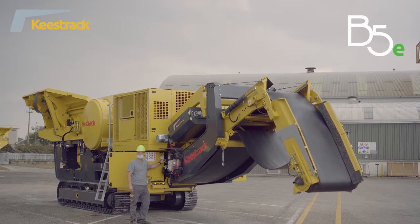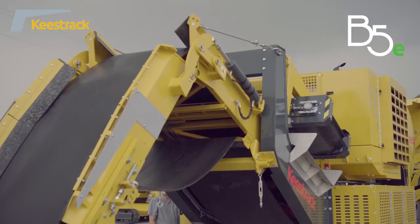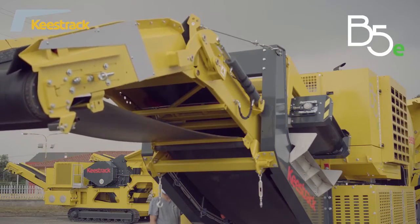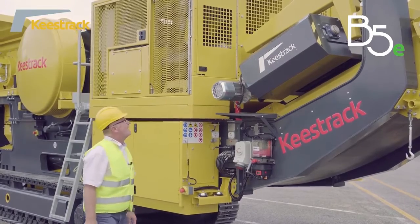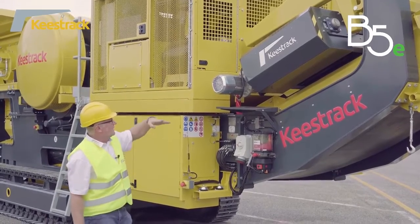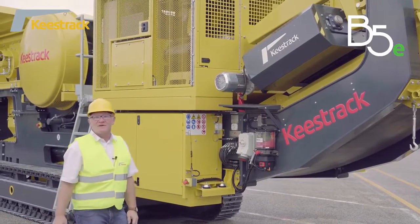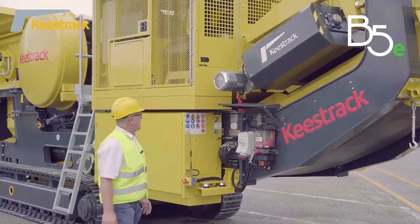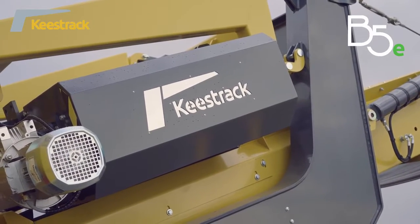For transport, the main discharge conveyor is foldable hydraulically. The drive of the main conveyor is performed by an electric drum motor with a capacity of 11 kilowatt. Optionally, a magnetic separator is available, either in a fixed position as here or with a hydraulic lifting and lowering system. The magnetic separator can be delivered either in neodymium or in ferrite design.